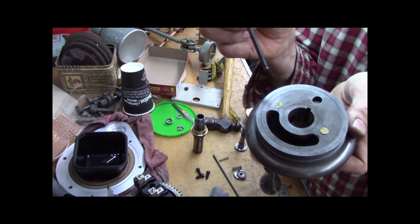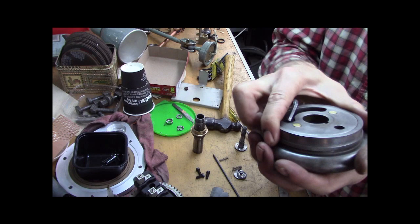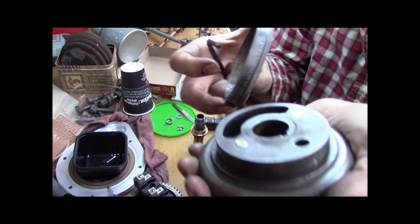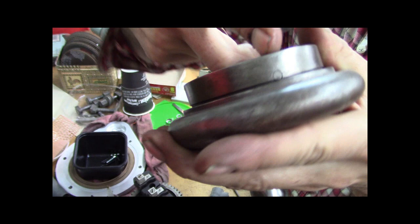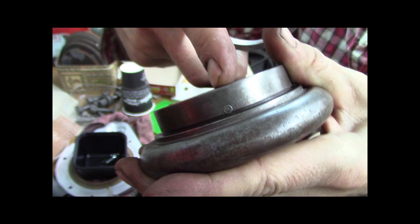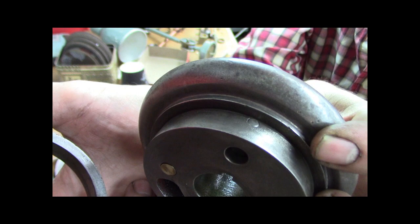And when you tighten this, it forces out. Well, I'll show you. You loosen it, I'm loosening that, and the ring comes off, okay? So you can see the ring, obviously, right? But the key part, if you can see it, I hope you can, see that little dowel pin? That comes up, right? There's like a little taper on that, probably 20 degree angle cone, and it forces that up and it binds up on the inside of this ring.